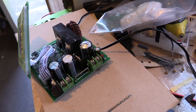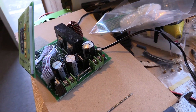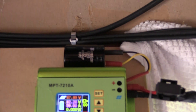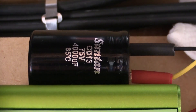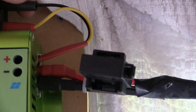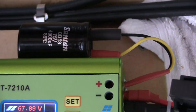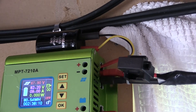I'll replace it very similar to what I did in the other videos and we'll see if it works. It's back on the wall. What I've done is used one capacitor — I managed to find at the local electronics store a 75 volt 4000 microfarad. The advantage of this one is it's got some termination parts so that you can just use a plug, which means it's nice and easy to unplug again.